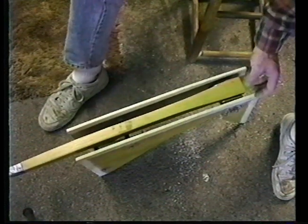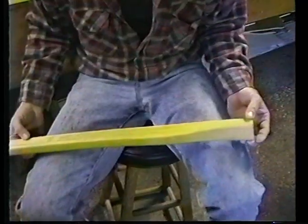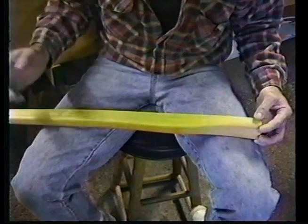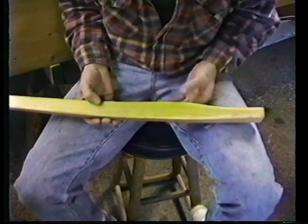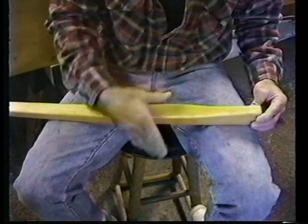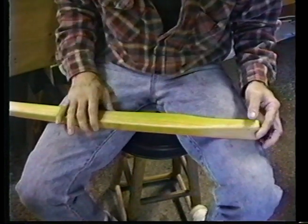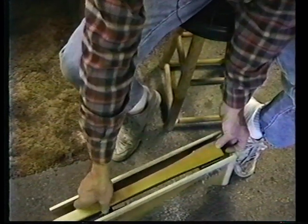We also have, I'm going to pick this up and bring it into my lab. Before this can be bonded to that upper casting, we have to take one ply of bid on the backside. You notice the backside is characterized by this hump. One ply of bid running this direction, allowed to cure, trimmed off edge radius, and then one ply of bid going from the front face aft, trimmed off, and then you're going to position this back inside this casting. This casting will have been removed, but we have to position it.